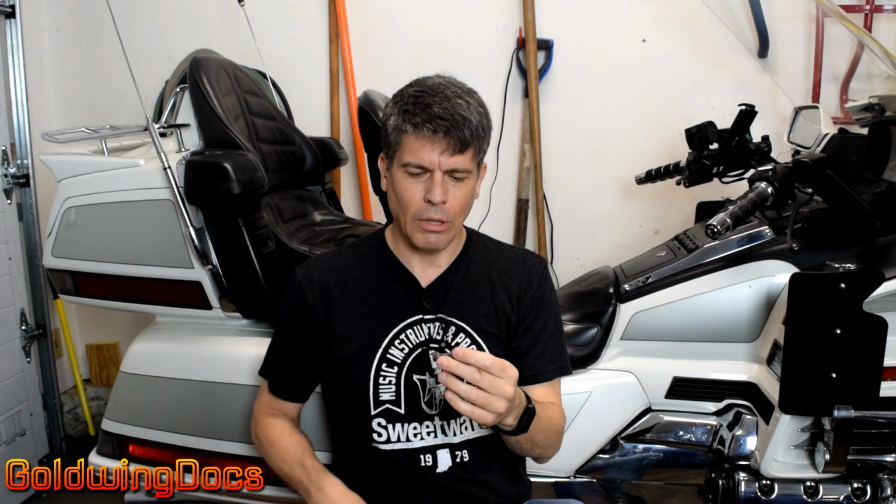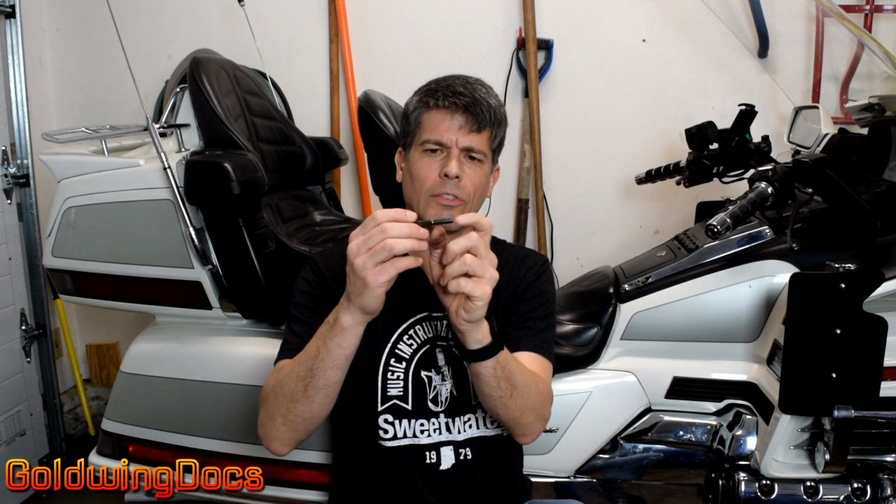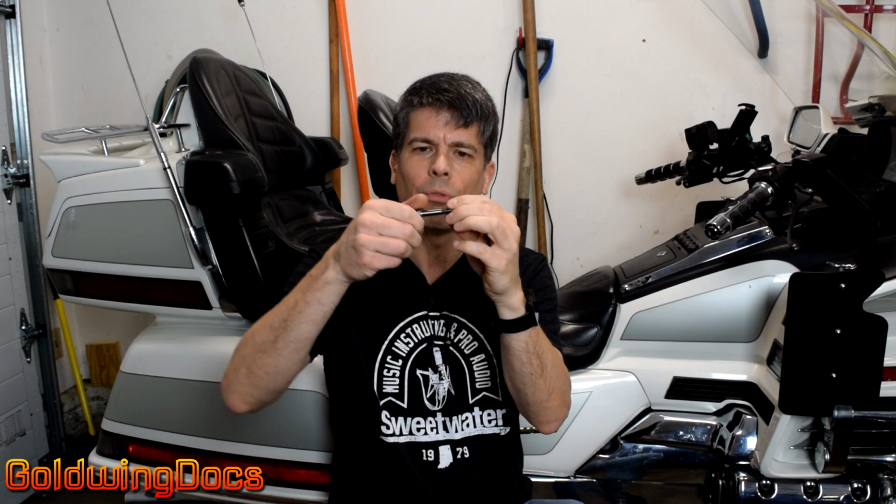So obviously, you want to tighten these fasteners to a specific amount. If you tighten it too far, you'll go beyond the elasticity of the steel and the fastener will break. And if you don't tighten it enough, you haven't got sufficient friction against the threads and the head to hold it in place, and it will vibrate loose and fall out. So how do you know exactly how tight to fasten these fasteners?